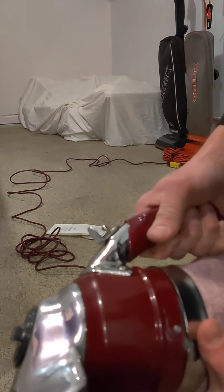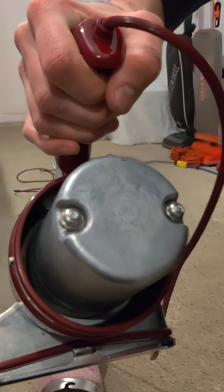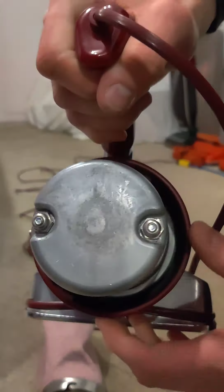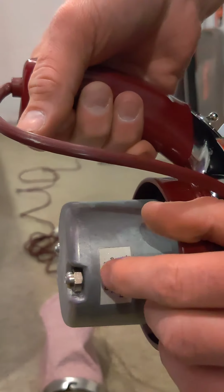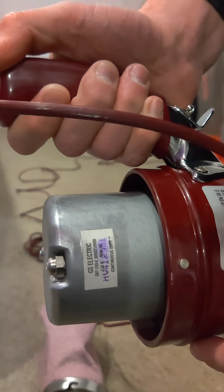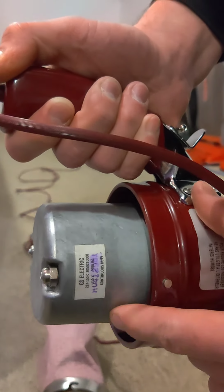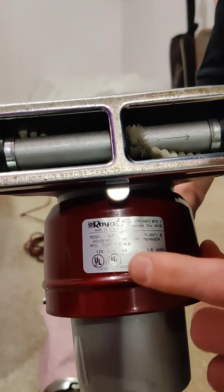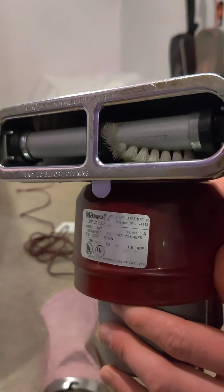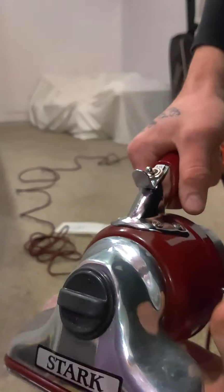But I went through this, took apart the entire motor housing, cleaned it up, polished it up. I replaced these two nuts on the back of the housing that hold it in place, the 10-32 nuts, with stainless steel open-ended cap screws. I put it's not tape, it's basically half of a laminating pouch over the original label to seal it, and I plan on doing the same thing with the manufacturer's specification label before it gets worn off any more than it already has.